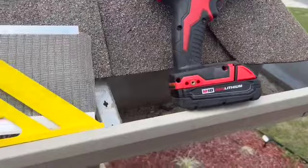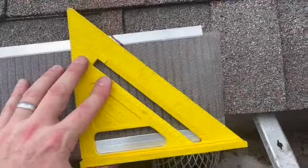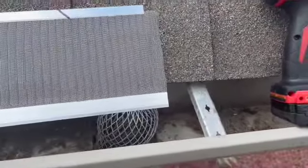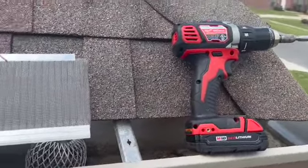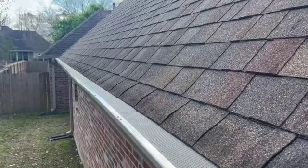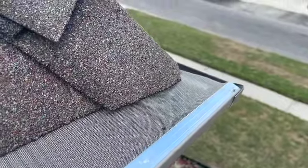Our angle is a 45 degrees — all I did was line the triangle up with the edge of the metal and put my black line there. We'll use the snips just like we did on the other end to cut there, then cut along that line to remove the piece, fold the mesh under, and then do the same to make the corner with the 45 on the other side. You can see we're around that first corner and the trimmed 45 meets the run going the other way.